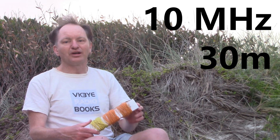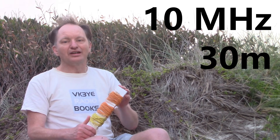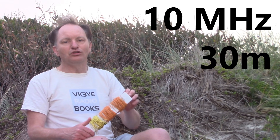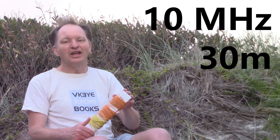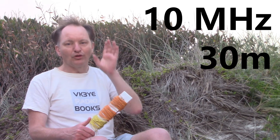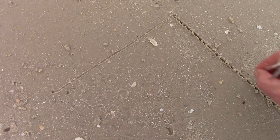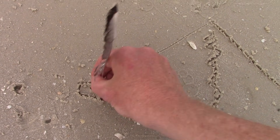At 10 megahertz, this is where 15 metres of wire really comes into its own as an effective antenna, and there are different configurations. It's a half wavelength on the 30 metre band, which is 10 megahertz. So you can use it for all sorts of things. You can cut it into two halves — about 7.5 metres each — and feed it in the centre as a half wave dipole. That needs coax feed line, but it presents a good 50 to 75 ohm impedance so that will work fine. Alternatively, as an end-fed half wave, you can have a pole maybe 6 or 7 metres tall in the middle, feed it like an end-fed inverted V, and that will be a very efficient antenna.